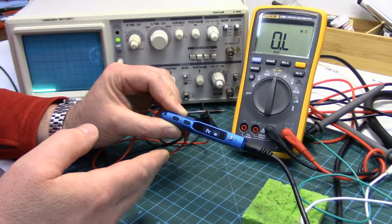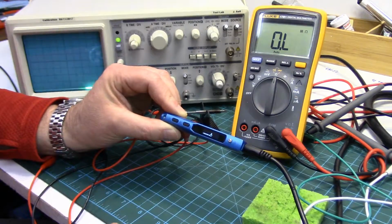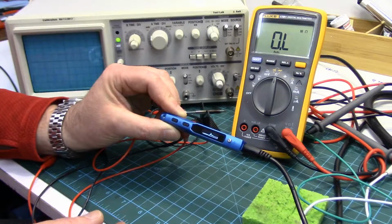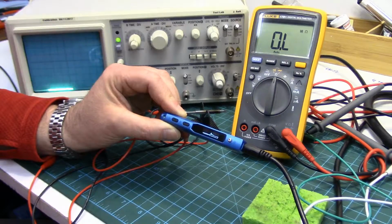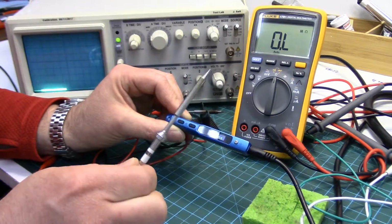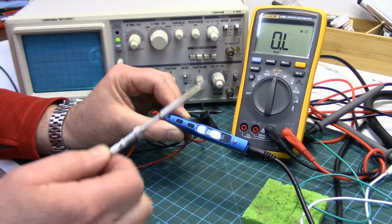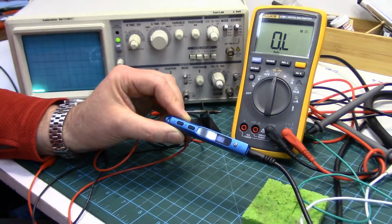I have been using it a fair amount over the past 2 weeks, giving it a good test drive on anything as small as some surface mount resistors on a circuit board right up to a big XT90 4S custom wiring harness I built for a customer, and it does everything so well. And like so many people have said, once you use a cartridge style or one of these integrated tip technology soldering irons or soldering stations, you'll never go back to the old ceramic slide-on tips. And I can totally understand why now.